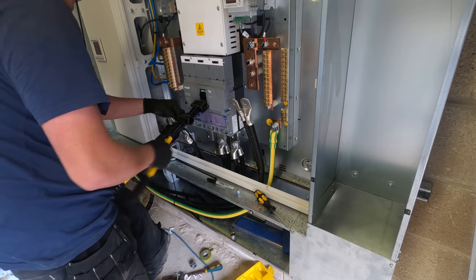When we tested it, it was 0.89. Now we've livened it up, we've bonded the steelwork in that unit and stuff. It's now tested out under live conditions, doing a live test at 0.60. So it would actually pass on this, which is annoying. You know, it would have just been okay on this breaker. But yeah, we put that in because when we dead tested it, when we validated it, it wouldn't have passed. So, you know, but yeah, living and learning.